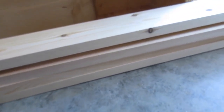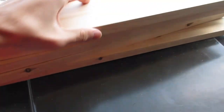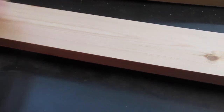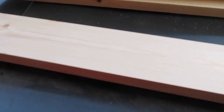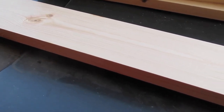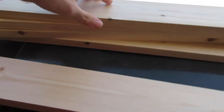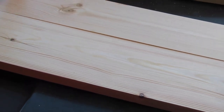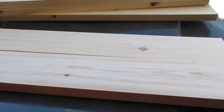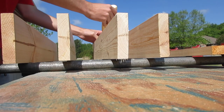It's going to be 24x18. Here's these boards, and I'll show a little bit more about that in a second. Okay, so I just cut these 24-inch pieces, and I'll glue them together. There'll be five of them, because 5 times 3.5 is 17.5. It's supposed to be 24x18, half inch off, I think that's okay. So, glue them together like that. And then we'll put a cross member across, make it all flat, and some handles. So, let me glue this up.